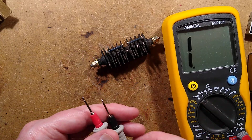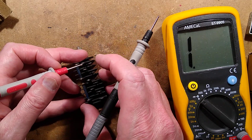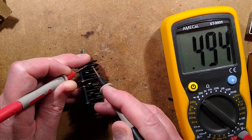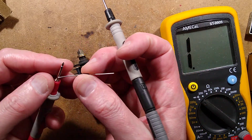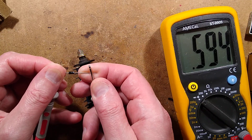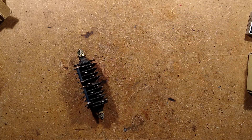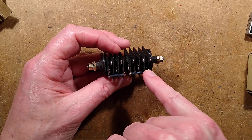Going from the negative to one of the AC connections, you can see the classic diode junction — it's really close to a silicon diode. Comparing it directly to a silicon diode, it's very similar; if anything, it's got a slightly lower forward voltage drop off-load than the silicon diode, but under load that changes. The official voltage drop of one of these diodes in this bridge rectifier is approximately one volt.